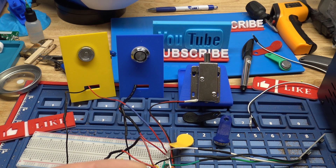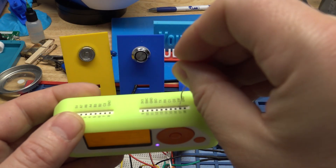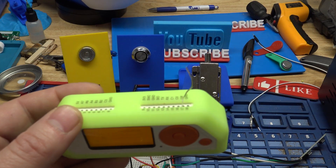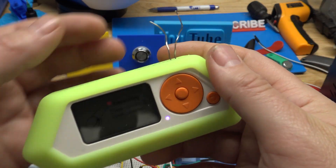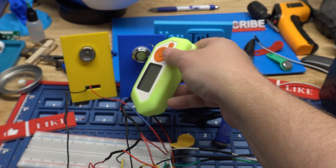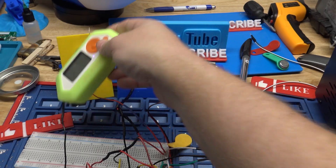The workaround is you can take some 22 gauge solid core wire and use the GPIO pins on top here. GPIO 17 is what corresponds with the bottom, and GPIO 18 is ground. On iButton, the positive is going to be inside the reader and the outside ring is the negative. So while it's emulating, if you just touch it, it actually will throw the actuator. That's a little bit of a workaround for it.